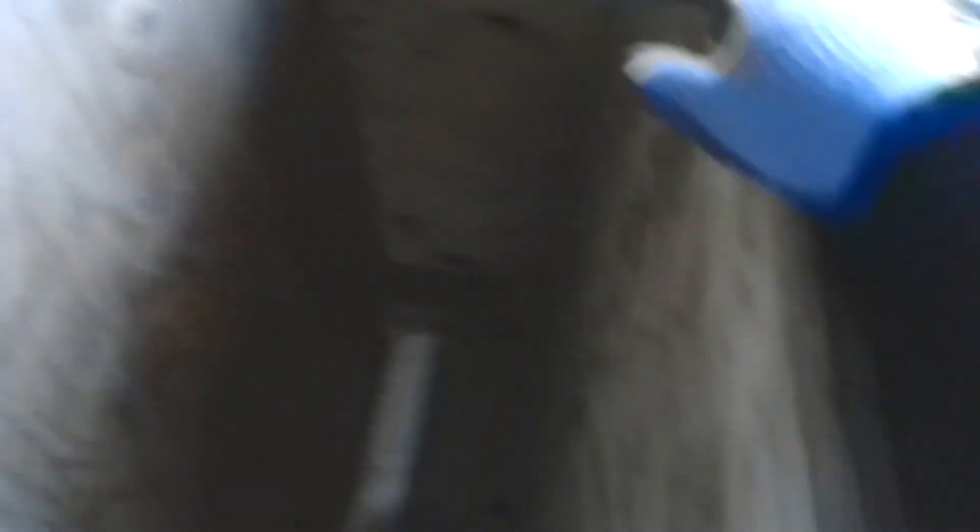Before I finish this, let me show you exactly what we've got going on. We now have our feeder box, which will be enclosed. Feed will fill up this box and slide through this gap. As long as there's pressure on this side to push down on that feed — which the feed itself will do with this slant — it'll fill this box. As the pigs eat, it will just keep replenishing, so they can eat as much as they want. It gives a nice solid amount to fill.